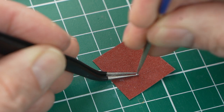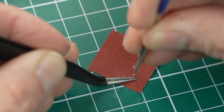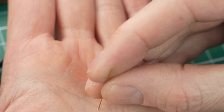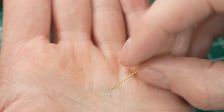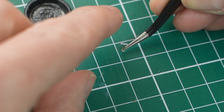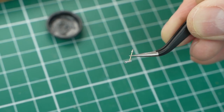Underneath the mirror body there is a small joint for adjusting. I made this super tiny ring from the same aluminium tube I used before. The ring is first test fitted to a leftover brass rod. Haha, yeah, it looks so cute. It touched me. I fixed the ring to the real deal and with that the mirror arm was complete.